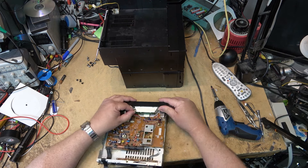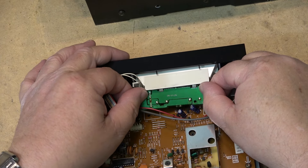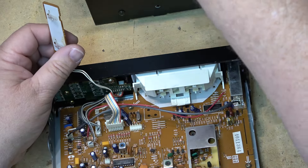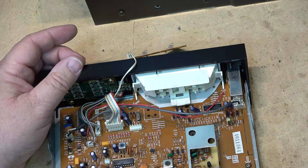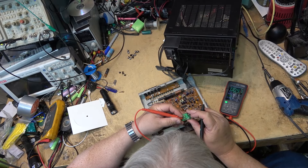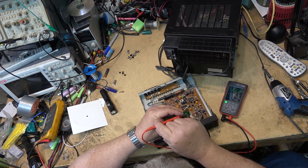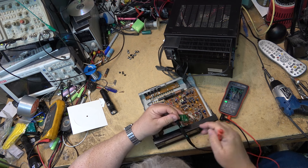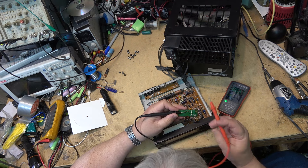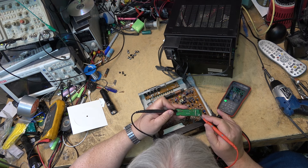It should just swing out from the bottom and lift out just like this. There are the little bulbs. Let me hook up the power and measure the voltage on these lamps. Measuring across the input — 22 volts coming in, and yet nothing on the bulbs. Oh, these bulbs are in series — that's why.